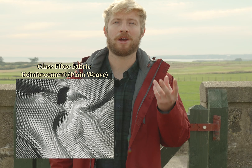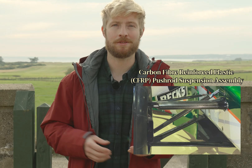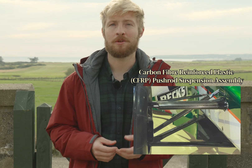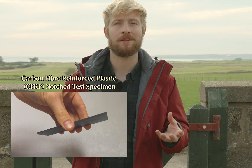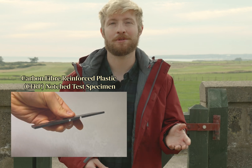The first material we'll look at is glass fiber, and it's the primary reinforcement in most wind turbine blades. However it's worth clearing up a common misconception. When people say fiberglass or carbon fiber they're often mistakenly referring to the finished composite part, but in reality fibers are only part of the picture. They're embedded within a plastic resin. The resin binds and protects whilst the fibers provide most of the strength and stiffness, so strictly speaking fiberglass or carbon fiber should only describe the reinforcement itself.